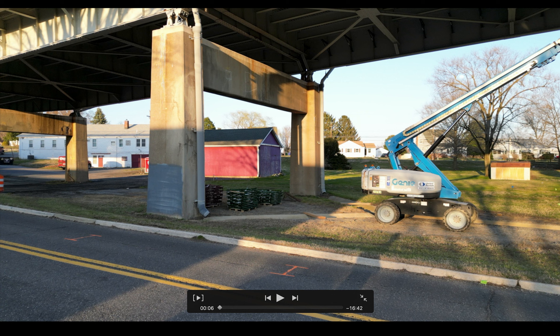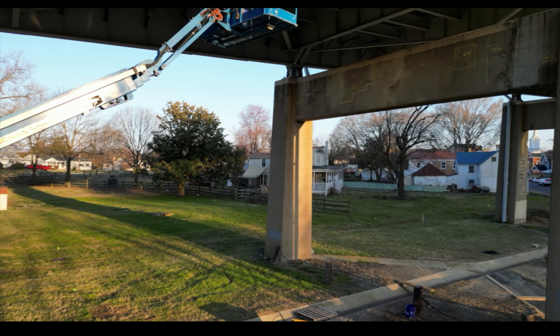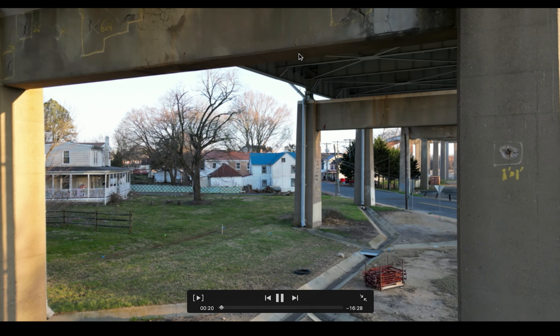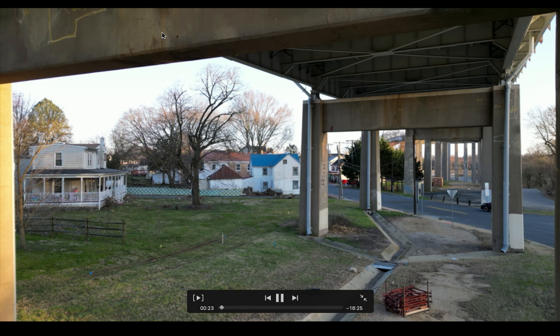These rockers can rust and lock up — I'm not saying these are rusted or locked up; I didn't dive deep into them. I was looking at the repair sections they were calling out, and if they were addressing the paint damage here, I did not see it written there. The repair size is one foot by one foot. This is the water damage from a section — water damage from the midsection. This bridge appears to have water coming to the midsection, not draining left and right where the drains are, but drainage coming down the middle. This is causing efflorescence and swelling of the rebar by water penetration through the concrete.